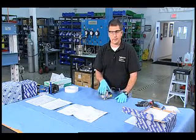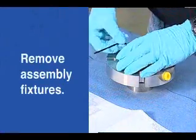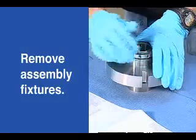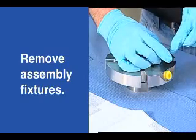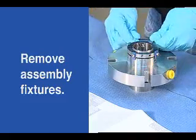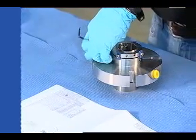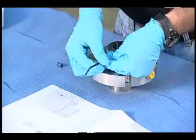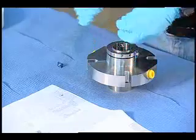You don't want to lose that evidence. It really doesn't take any time — it actually saves time. Let's start with the assembly fixtures, get all loosened up. For the purposes of this video I'm not going to tag everything absolutely exactly as it was found because that would take unnecessary time — you get the point. But we are going to tag the critical ones. The objective here is not to disassemble the seal as fast as possible and show off in front of the customer about how good we are with an allen wrench. The idea is actually to inspect the parts as you go, so take some time.